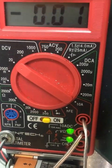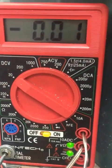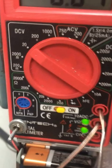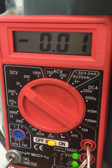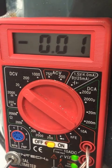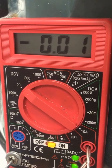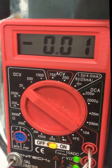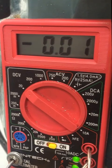The goal here is to make sure that this edge finder is one hundred percent reliable, and there are no conditions under which it gives you the wrong answer. If you do see a low number and you want a touchdown, then you just give the spindle a slight turn, and that causes the spindle resistance to go way up, and you can go ahead and do your touchdown.